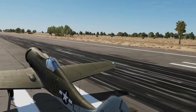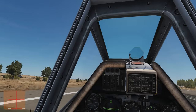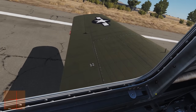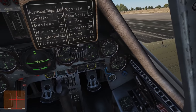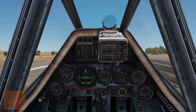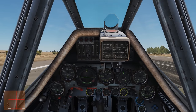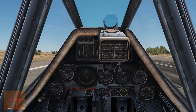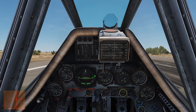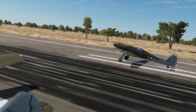One last little quick check. Make sure that your flaps are correct. Yeah, standby. That your oxygen is turned on. Flaps are 10 degrees. Oxygen is functioning. Yep. Also, while you're on the ground, the ADI can drift somewhat, so if that has happened, just cage it and uncage. Okay, stand by. Fixed. Ready for you to go.